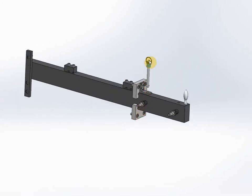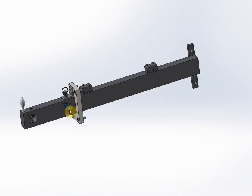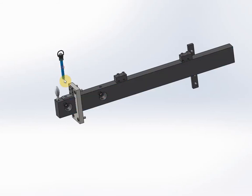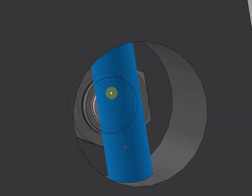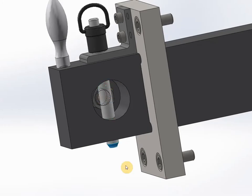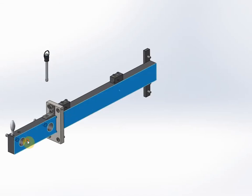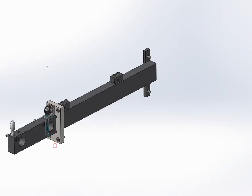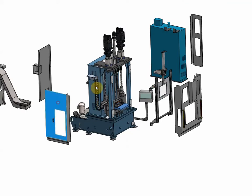A quick look at how it is made. That small pin will be released in order to move from one position to the next. Inside the big safety pin there is a proximity switch which will signal one of the two positions. For each position we will have a separate proximity sensor, providing two signals going into the machine control system.